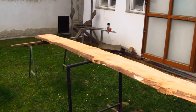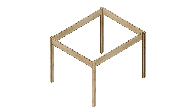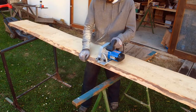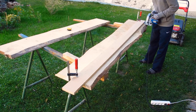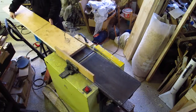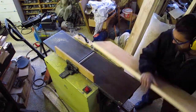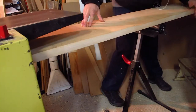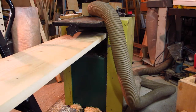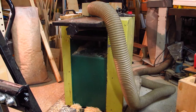The boards are a similar story. I need four of them, so first I sorted out the rough lumber with a circular saw, then used the jointer and planer to make the boards flat. As you can see these are pretty big, so the adjustable roller stands came in really handy.